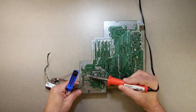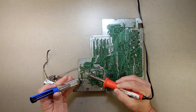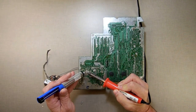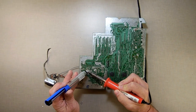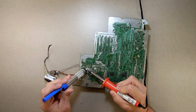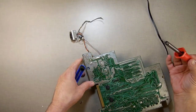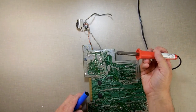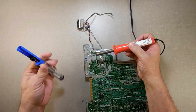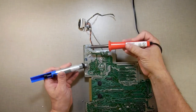I'm going to push on it a little bit just to try to make sure it's separated and then suck out a little more if I can. One reason it's hard to get all this solder out is because the RF modulator can is actually absorbing a lot of the heat you're putting into it. There's one over here too — so there are five on this one.